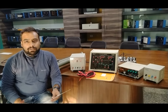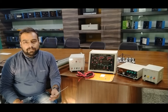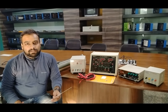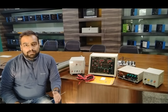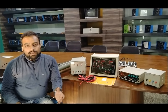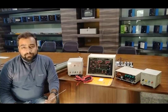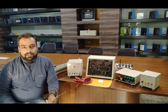A cycloconverter is a device in which we can convert a fixed frequency AC current by means of using semiconductor devices forming a bridge circuit of thyristors. Using this we can convert fixed AC of a fixed frequency to a variable frequency AC. The cycloconverter converts the frequency and we can observe the output waveforms as the frequency changes.